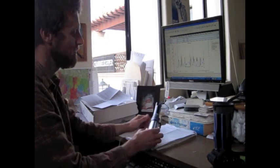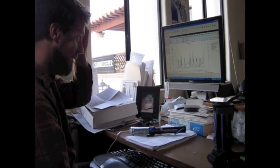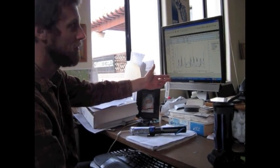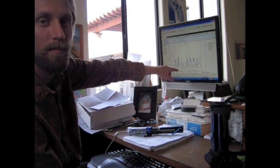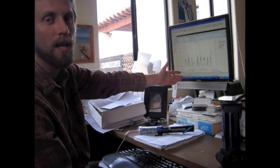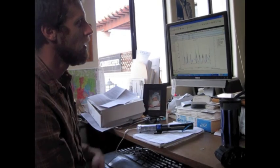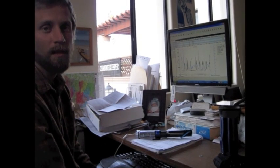Here we are back in the office. You can see we've connected the sensor to the computer and just plotted the output. It did a pretty good job at detecting discharges. It looks like about every 12 hours there's been a discharge — it goes from 0 millisiemens up to about 20 millisiemens. Remember the standard's at 3, so we're exceeding the water quality standard. It looks like we've got 8 occurrences just in one week. I'd say this was a pretty successful experiment. The equipment worked like we were hoping, and now we've got evidence and information that we can use to enforce these Clean Water Act violations if we need to. Mission accomplished.